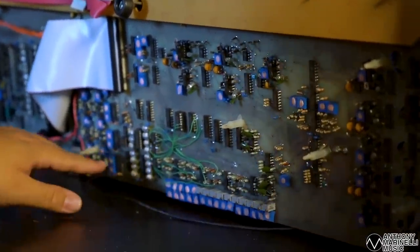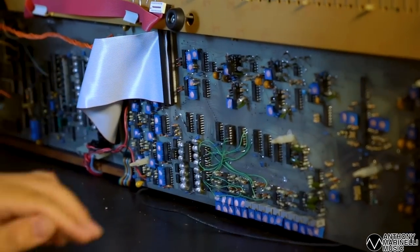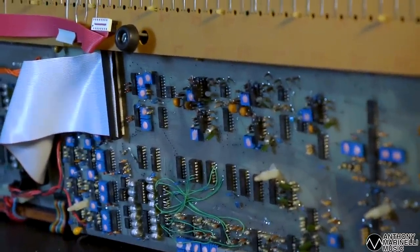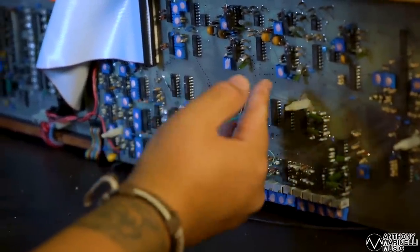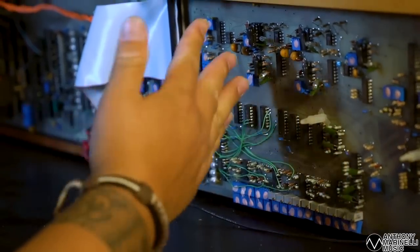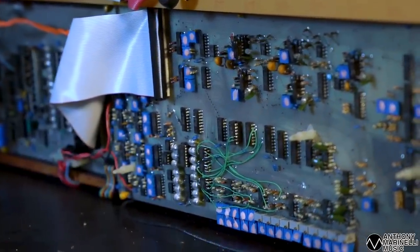You have your analog board which receives all these control voltages and makes even more of its own - there's more multiplexing going on. You have all your envelope chips here - those are all SSM-based envelopes. Here are all your oscillators with nice goopy Tempco resistors which sense the temperature and compensate a little bit, though they're very unstable even with that. You see all this green wiring - this is all Kludge wire, Kynar wire. They ran out of routing spaces on the board, so they add buffers that tack onto the chip below. It's pretty raunchy as far as synth design goes for these Rev 1s, but they are amazing nonetheless.